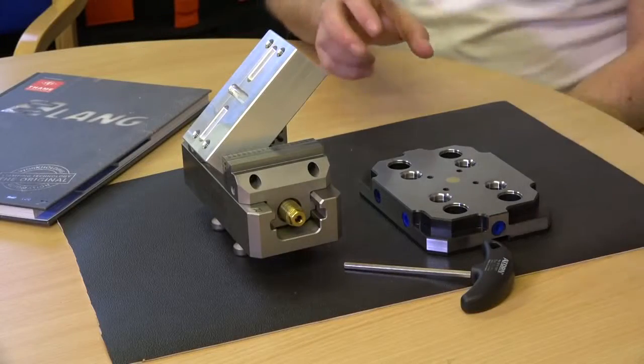Also, if you had a QuickPoint on all of your machining centres, you could go from machining centre to machining centre with no need to re-clock or reset parts. Exactly. As I say, these centre within four microns and the idea is that you have them on all your machines.